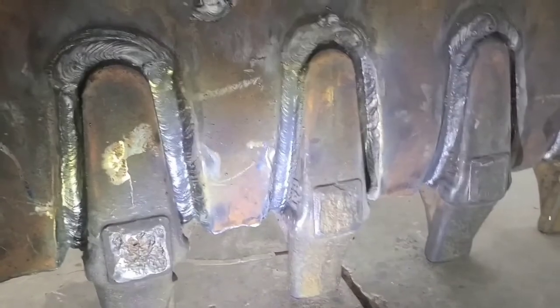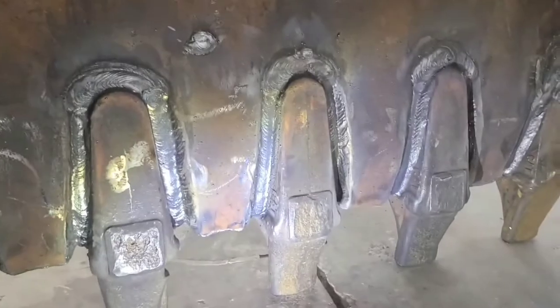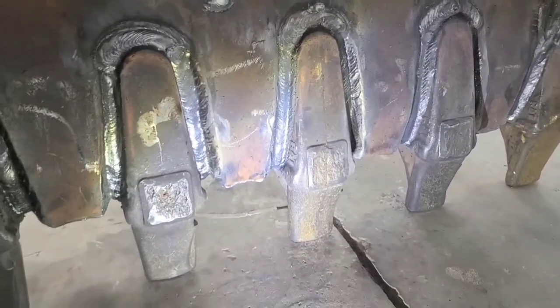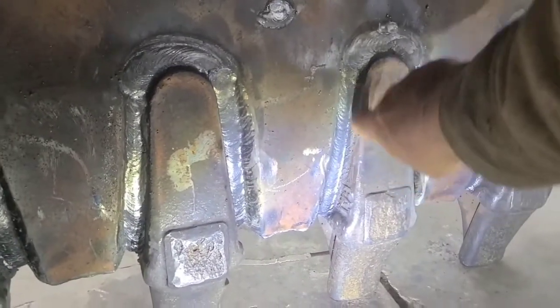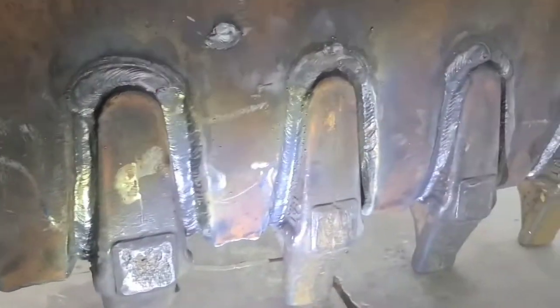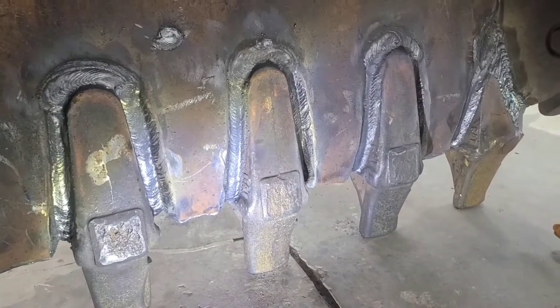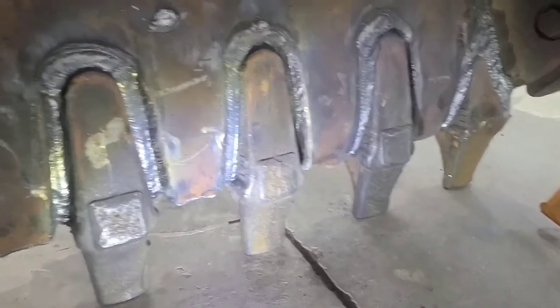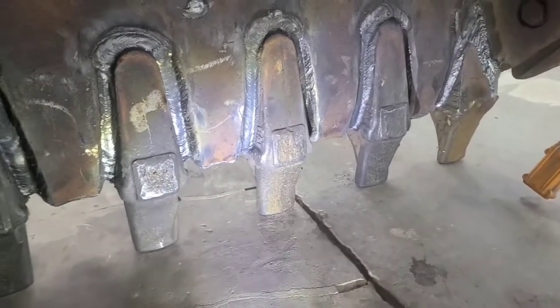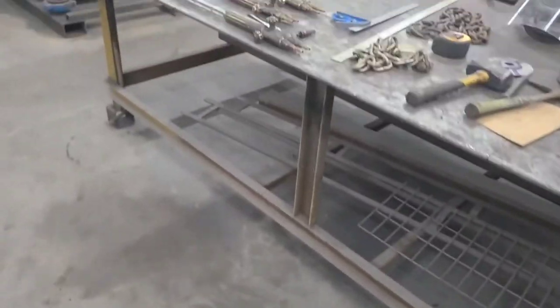But I didn't fill it so full of weld that, you know, you couldn't find the edge of the shank. If I needed to burn one of these shanks off, it wouldn't be that big of a deal. And these hard shanks are protecting that softer weld metal, because the way they come, they're so beveled. You got plenty of room to put weld under them, and that weld's not gonna wear off until this really hard shank material's all gone. So, you know, that part of the work,